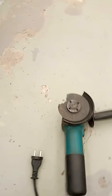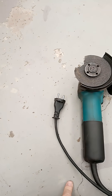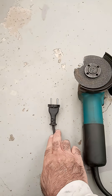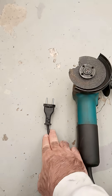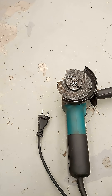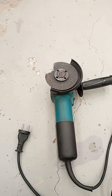This is where the reason for the plug comes in. As soon as I threw the angle grinder, I rushed straight over to the plug point, grabbed the cable, and just pulled. The plug comes out. If you had a three-pin plug or some other fancy plug, you would not be able to do this — it would take you a few seconds to grab it properly and disconnect the two halves. With a two-pin, you just give it a rip and it comes out, and the power tool shuts off.